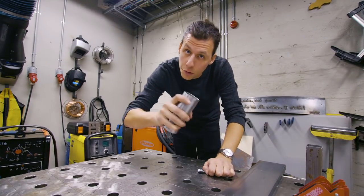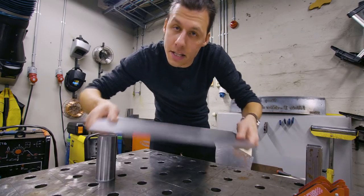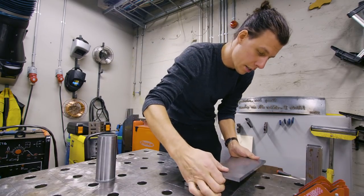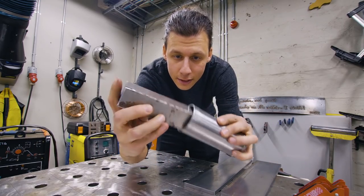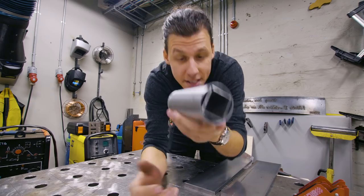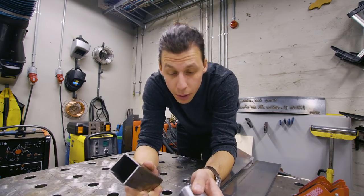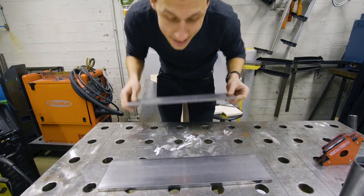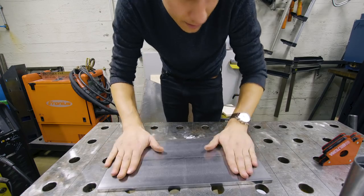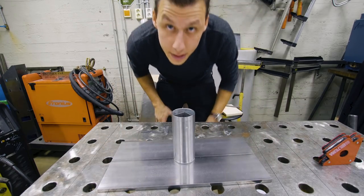We made our way over to the school workshop where I've cut two nice big pieces of flat stock. I also found this piece of square tubing that perfectly fits inside the tube that we just turned down. I'm going to weld this piece of square tubing on the inside of the pipe to give it a little bit more rigidity. Making sure everything is nice and flat and clamped against the table, we're going to weld this pipe to the center and then weld everything together.